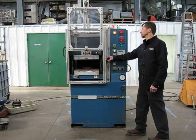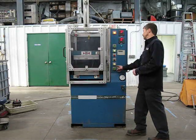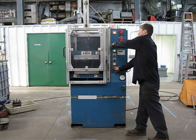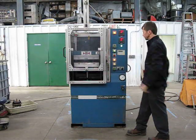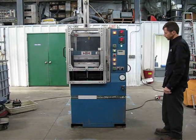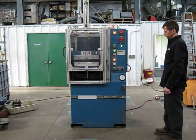So go ahead. Door closes, locks the front of the press. You've got to hold the buttons until you get a clamped light. Now in slow close, and you'll see the pressure gauge build up to 30 tons.